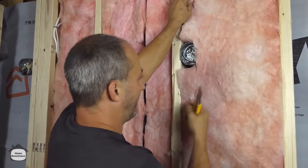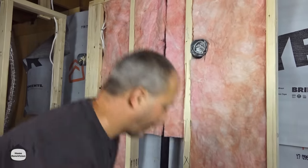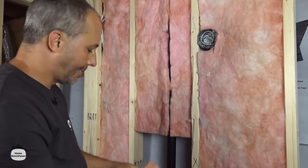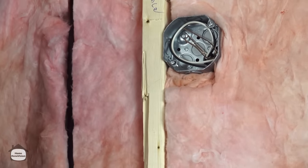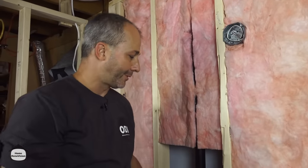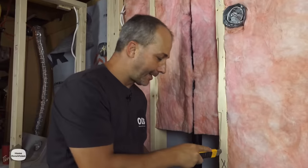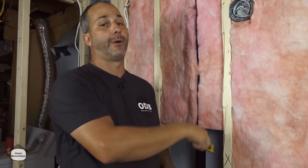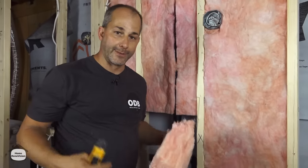This is a compression fit because we're using a 16-inch-on-center frame. If you see any gaps after you're done, take something to fill them — for goodness sake don't leave a gap around your boxes. We're using a traditional fiberglass pink product here, an R12 made for 2x4 walls. In our district if you have a 2x4 wall upstairs you have a 2x4 wall downstairs; if it's 2x6 upstairs you've got to make a 2x6 wall in your basement and insulate to R20, just like upstairs. The idea is to make sure every aspect of the house is insulated to the same degree.